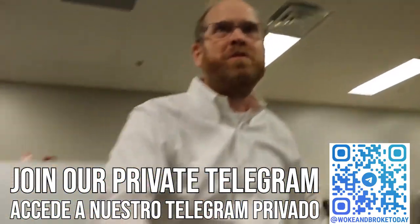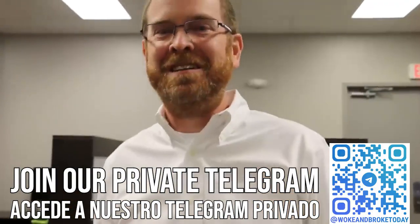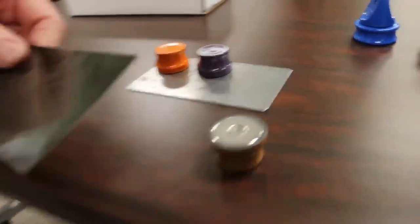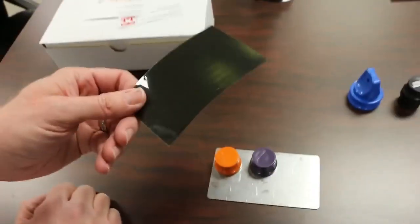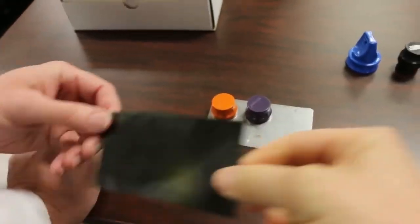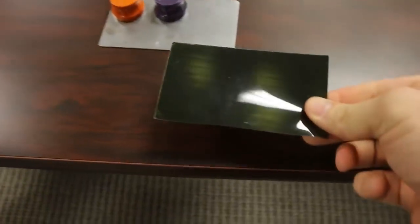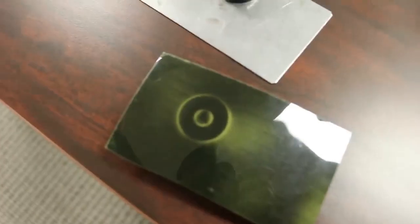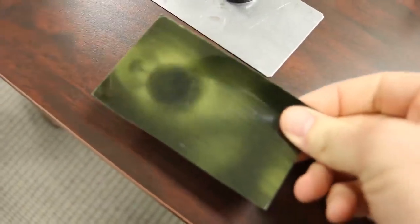This is Jason Morgan, Head of Engineering. He's agreed to teach me about polymagnets and show me some stuff that most people don't get to see. So, this is a conventional magnet. If you look at the conventional magnet — wait, what is this? This is magnetic viewing film. What that does is it shows you the transition in the magnetic field, where the magnetic field transitions from north to south.